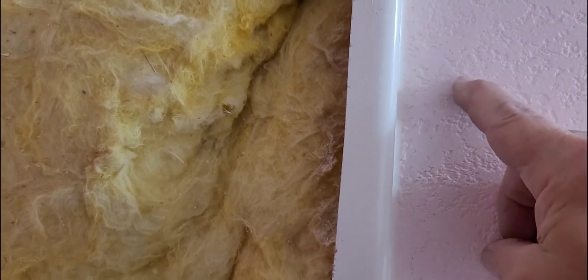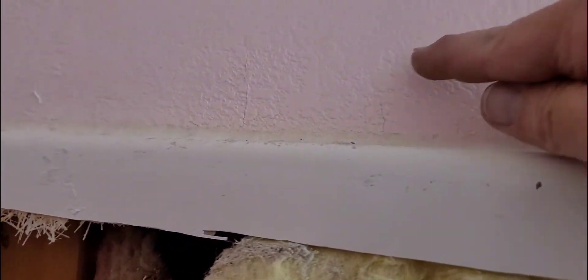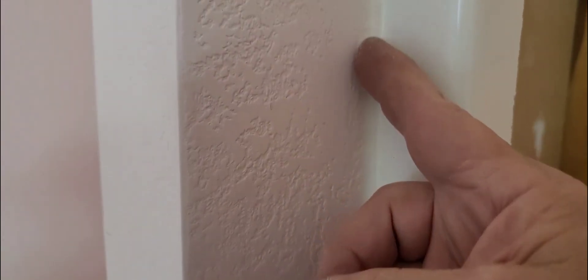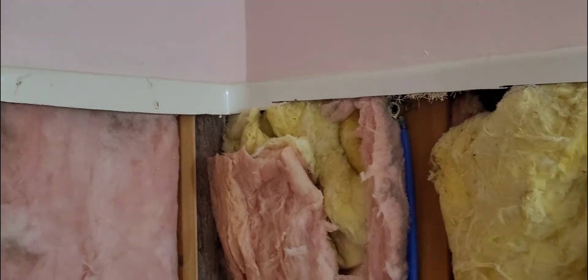To get the rest of this out, the flange is nailed onto the studs. I have an inch-and-a-quarter flange right here. Put a level line all the way around at inch and a quarter — or inch and a half to make it easier. Then use a sawzall, utility knife, or oscillating tool to cut the drywall. Once you cut it, pick the drywall out, cut down the seam, and that reveals the flange. The flange has fasteners attaching it to the studs — wherever there's a stud, there'll be a fastener. Pull out the fasteners and it'll fall right off.